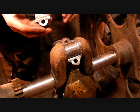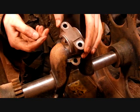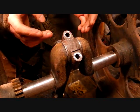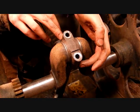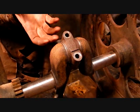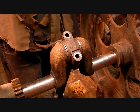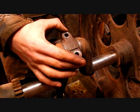The way babbitt bearings work is: they're clamped down and spinning away, and after a while the babbitt wears down before the steel does, and then you start getting some slop. What you can do is take some of the shims out from between the two bearing halves and tighten it back down again — that brings the two worn pieces of babbitt a little closer together and retightens your bearing. It's a pretty good setup.